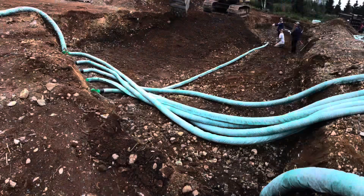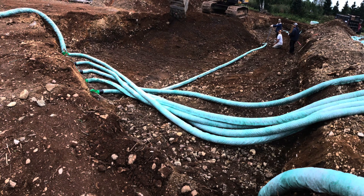They run almost 24 hours depending on the weather and temperatures. Today it's actually two degrees outside; last night it was freezing. Because of the geothermal, we were able to keep it up to 12 degrees inside the greenhouse. Today is supposed to have a lot of cloud cover, so we won't get as much heat to put in the ground, and we'll reduce the amount of suction in the fans. This will stop putting cold air in the ground, and we'll actually start the stove today.